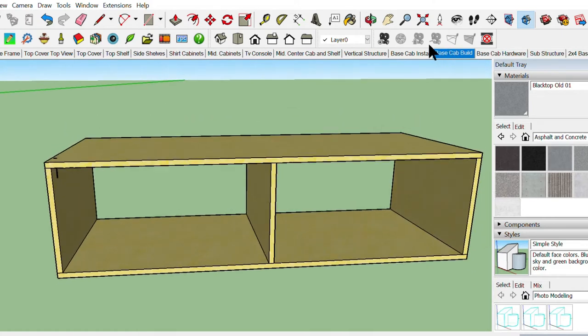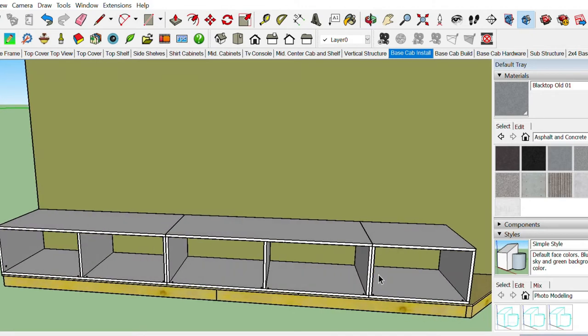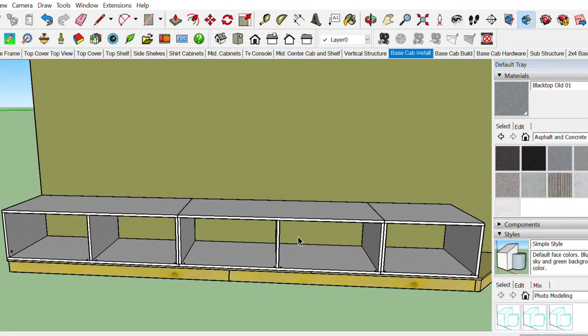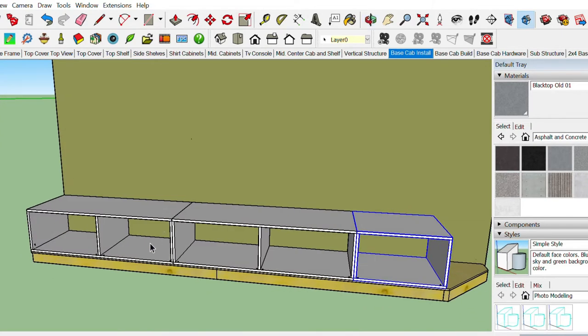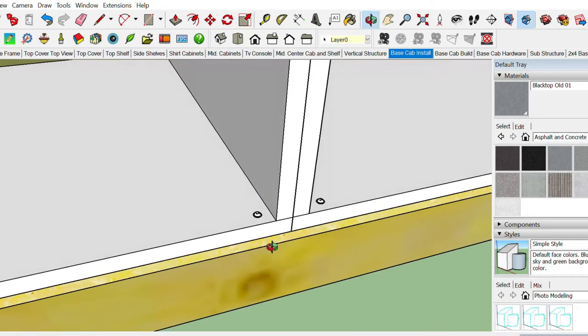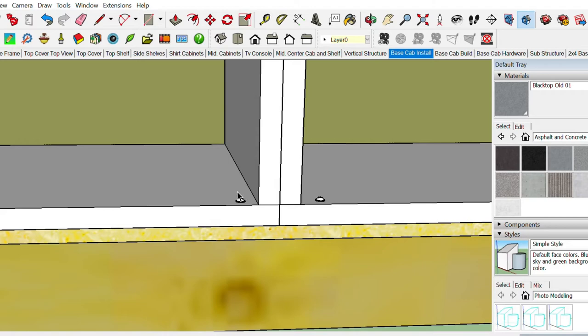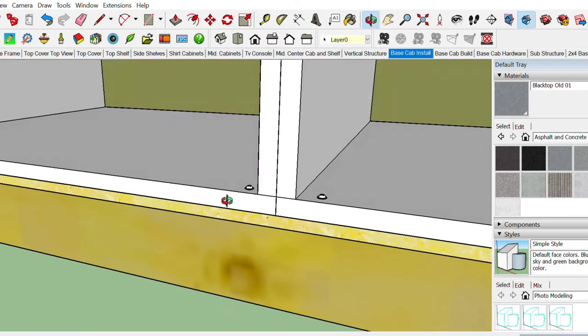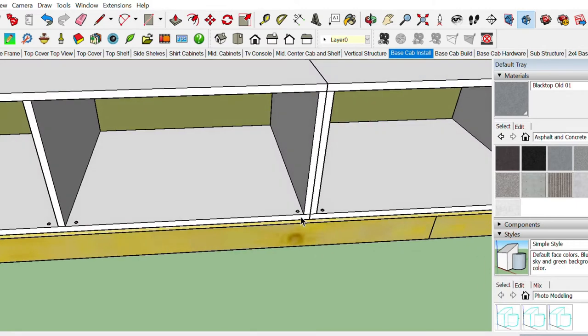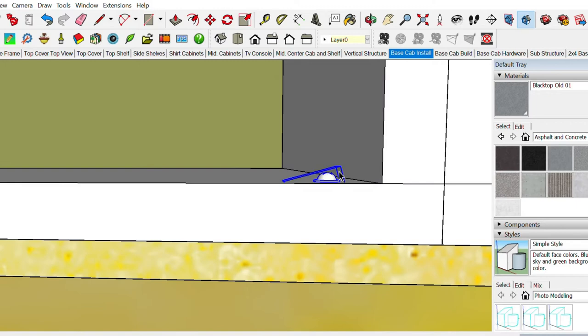The rhyme and reason for three boxes: the TV was identified as the centerpiece, so I took my TV square, drew a line, and divided these two sections by two — that's just the remainder. I screwed the boxes down with countersunk screws right into the particle board base, using inch-and-a-quarter screws that actually go into the 2x4 structure itself. In SketchUp I didn't recess the screw head, but in reality it's flush to the base.